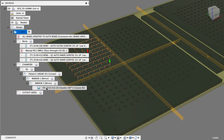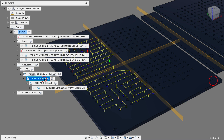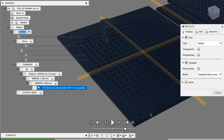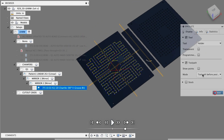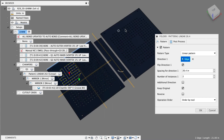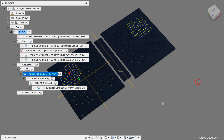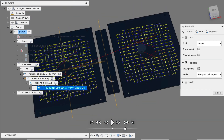Now when we go to do chamfers, I make one selection set, mirror that with a pattern, select this pattern, mirror that again, put that nested inside of it and mirror it the other way. What you get now with that simulation is the whole thing. I only selected 75 out of 300. In the case that these two are the same — which they are — I then did a linear pattern, copied all of those over from here to here. So I did a linear pattern, then a mirror over that. Now all of them get a selection.